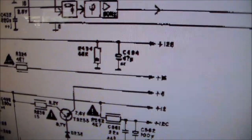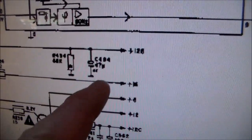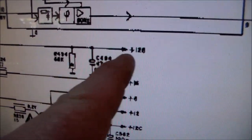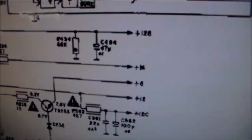I found the adjustment I need to make and also the cap I need to test across, C494. But there's not an easy way to get to it. If you notice, there's a resistor right next to it, R434. I'm supposed to check the voltage from one side of the cap, which is tied to ground, to the other side, which is tied to 125 volts. This resistor is doing the same thing, so it's an easier place to check the voltage. I checked it — it's very precarious, you don't want to get electroshocked — and it was 125 volts. So the operating voltage for that is right.